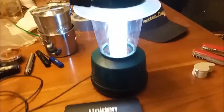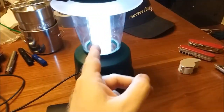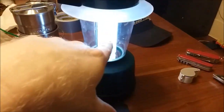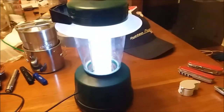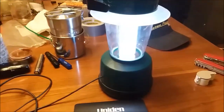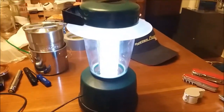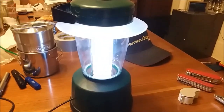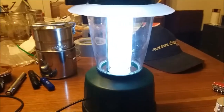Here's the weird thing: when I had this on a 9-volt pack first, those lights were only that bright. When I went down to 5 volts it stayed the same brightness — it didn't change at all. It's not the brightest lamp in the universe, but apparently there's some kind of regulator other than a drop resistor in there somewhere, because the brightness did not deteriorate with the lowering of the voltage.